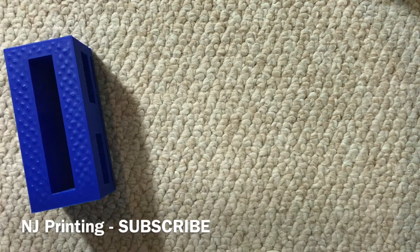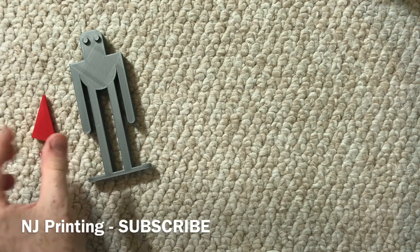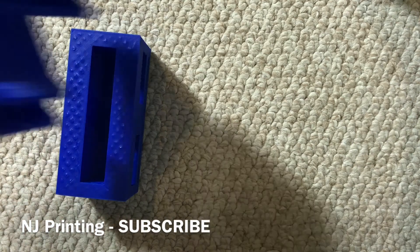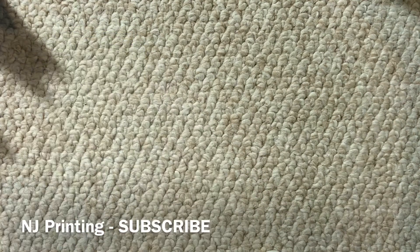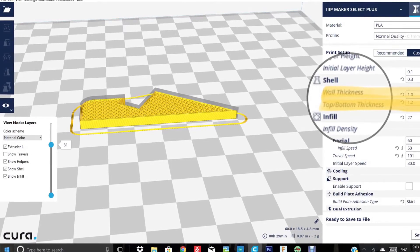Really, the way is what I just said — wall thickness. This and this were printed out in the low 20s, and these prints right here were printed out around the 30 range. They did not have a thick wall thickness. You can go into any slicer software — they all pretty much have a wall thickness or top-bottom thickness setting built in.